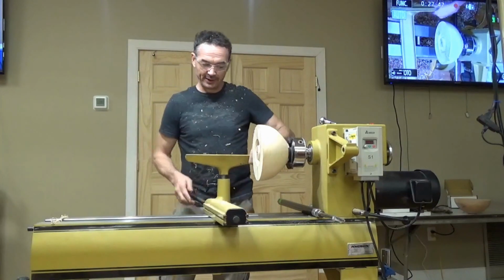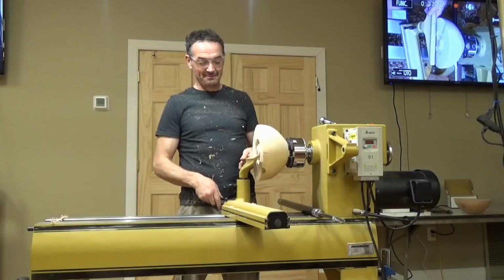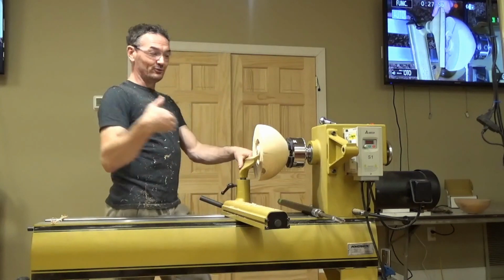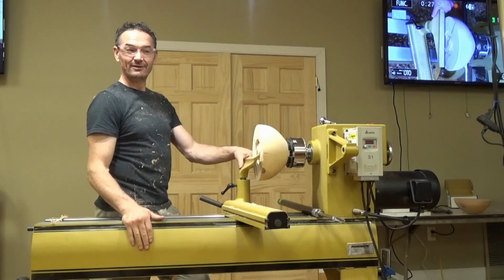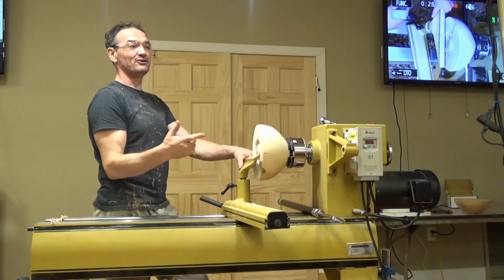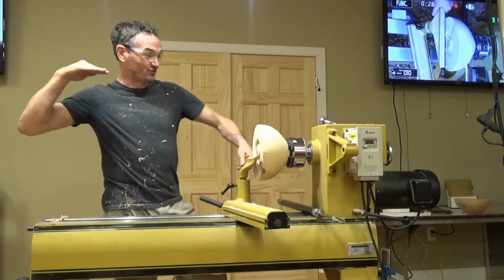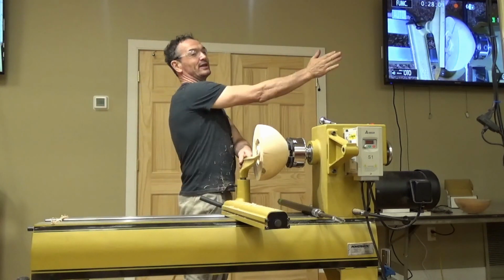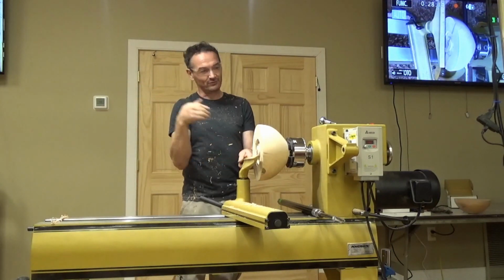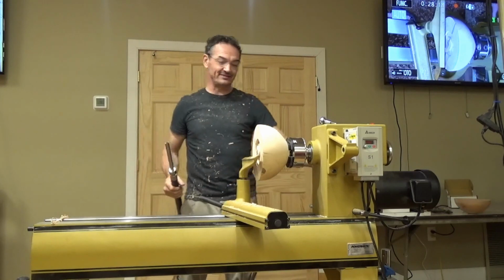Yeah, I can live with that. That's pretty good. Okay, now, hollowing out. It's amazing how many people work so hard to hollow out a bowl, and I'm like, man, that's not fun. It's so easy to hollow out the bowl. Don't swing round the bowl. The straighter in you go to get rid of all the bulk, the faster it is. When I race Mahoney, we don't ever swing into the bowl. It's too slow. We go in straight, straight, straight, then we swing at the end. If you swing, you're swinging towards end grain. There's a wall of end grain there. Don't swing until you have to. The straighter in I go, the faster I can get rid of the chips.